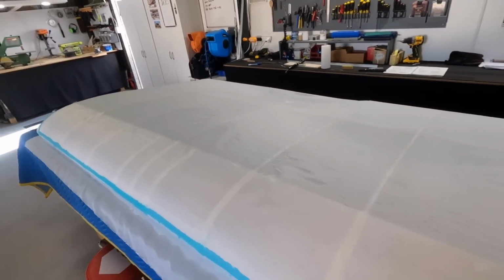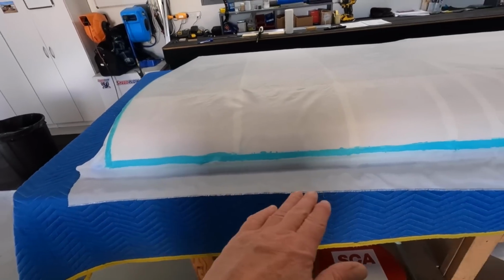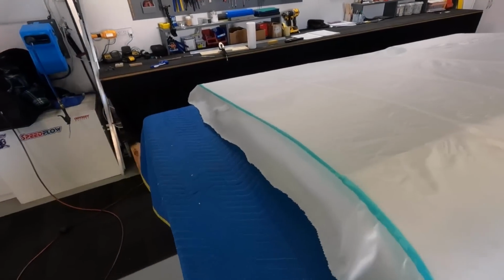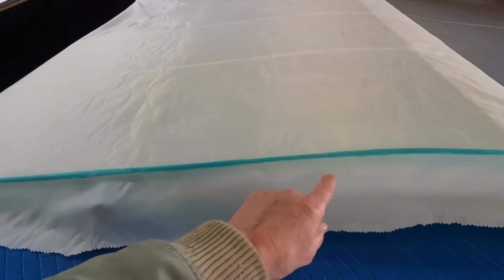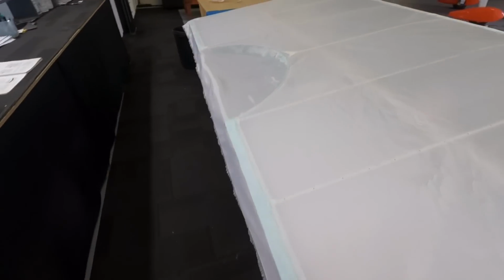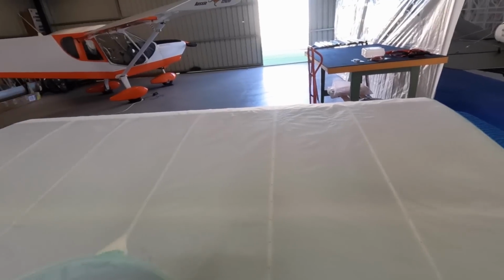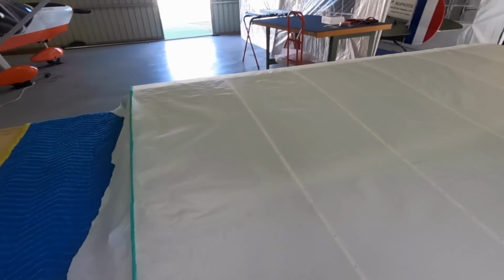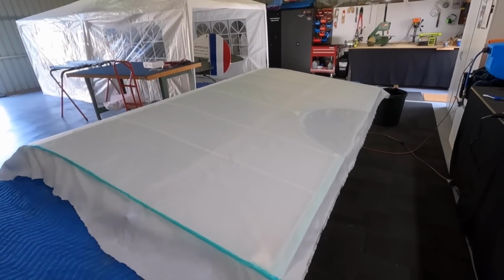I'm going to flip it over and do the trailing edge on the underneath, and I'll probably finish off the leading edge, roll it right under and glue it right on the tips. You know the drill: we marked down 1 inch, wet it out, cut it off, glue it down. Should get onto the tapes later today, or the rivet holes first. See how we go. It's nice to get it in one piece, doesn't look as busy. Just looks like a wing now. Nice.